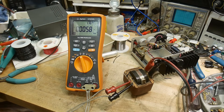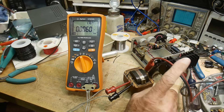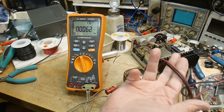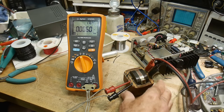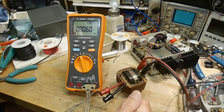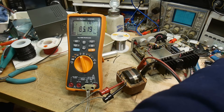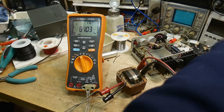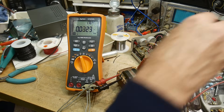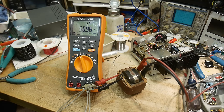Safety first - if you're going to do this, be very careful because these are lethal voltages. I have an isolation transformer in the back of the lab, so these are isolated from ground, which makes it a bit safer, but it's still very dangerous. I'm going to bring in 120 volts here and measure the outputs on AC volts. I get 81 volts on one winding and 57 volts on the other. Maybe the transformer's okay - that's good news.